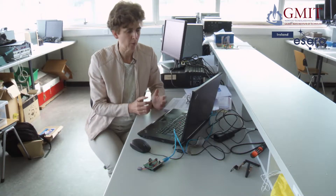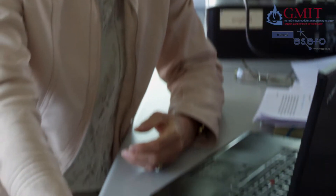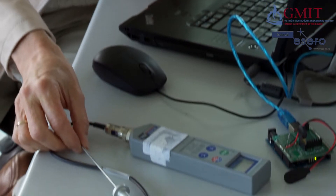Now what we'd like to do would be to change that voltage reading so instead of a voltage reading we get a temperature reading. To do that, we're going to need to calibrate our circuit. What I mean by that is we're going to have to compare our voltage readings with known temperatures and then establish a relationship between them, possibly get the line function between the voltage and the temperature. To calibrate our circuitry properly, we're going to need a reference thermometer. So I'm going to use this one as an accurate thermometer to compare with.